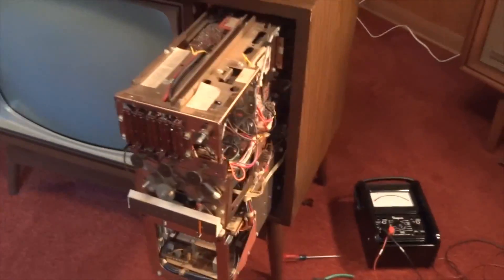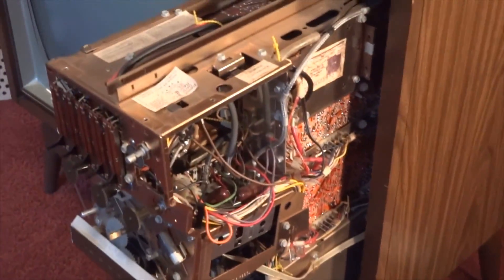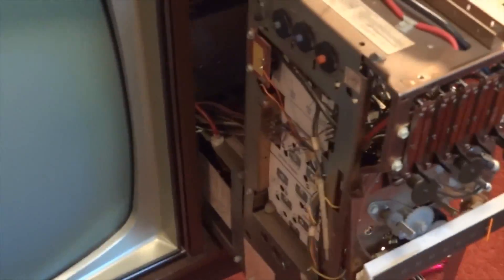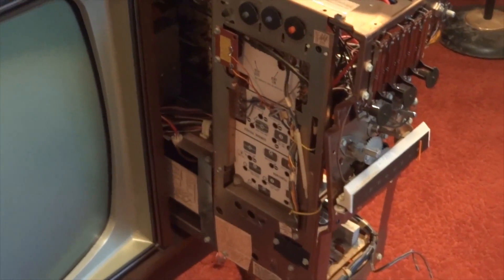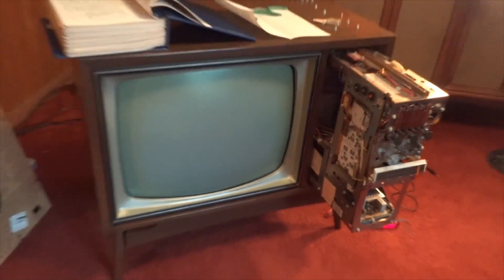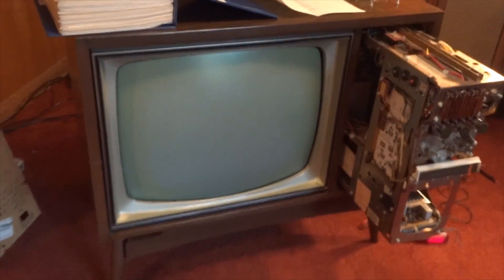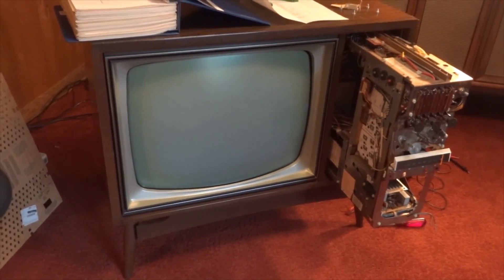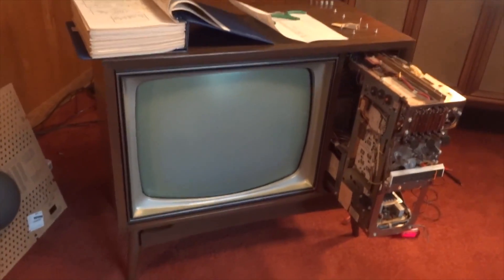Many sets had a very short lifespan as a result of this feature. The chassis itself, such as the TS915, was no problem because it's all solid state — there was no lower voltage needed for any of the circuits since there's no warm-up time required for solid state devices. But other sets that used instant-on tube-type chassis meant that the chassis tubes were also partially operating even when the set was turned off.